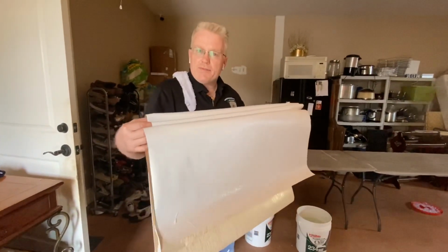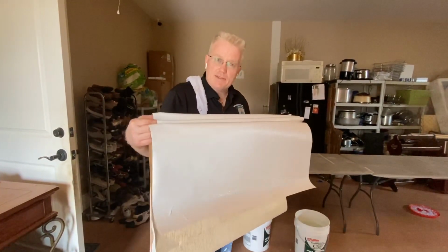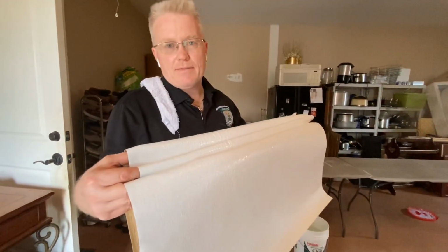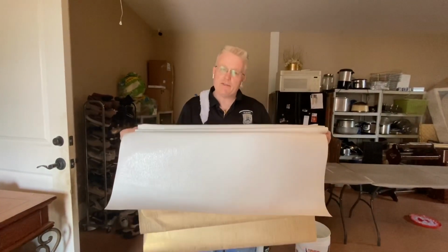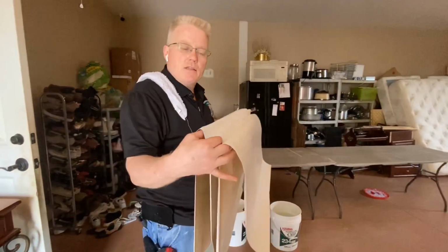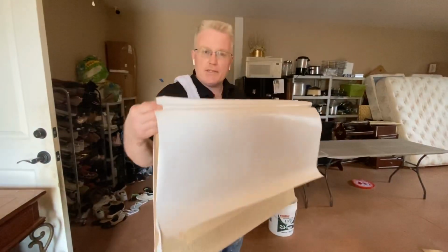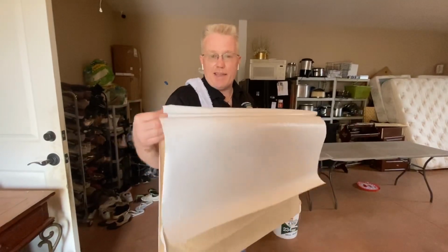So that you don't have 12 feet of wallpaper hanging over your face. You'll only have the amount that you see folded. And the rest will be sustained in the hands of your helper. See, if I were to demonstrate this now, if you just imagine the wall covering being opened at each fold, it will be sustained in sections, and it will be far easier to handle like this.